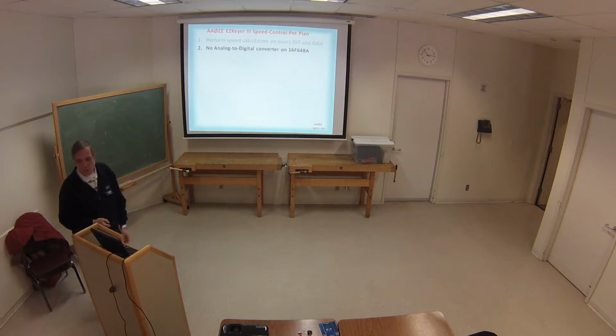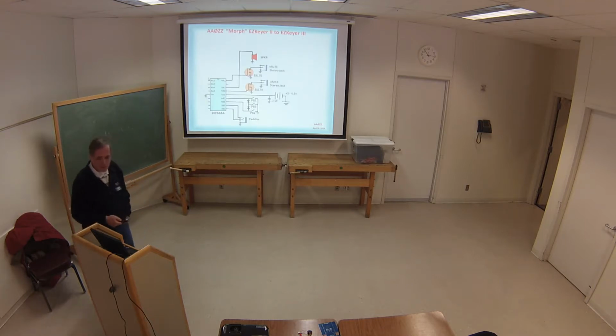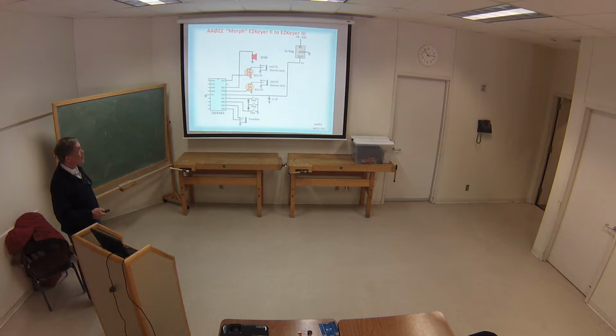There's no analog to digital converter on the 648 that I'm using, so I'm implementing what they call a poor man's A to D converter. And I'll show you how I do that. It's a published technique, I guess, but I kind of figured it out on my own, and then I went back and looked, and there were some other examples of how people have done this. So I'm going to show you the changes that I had to do when I went to the keyer 3.